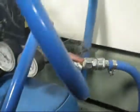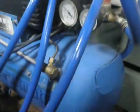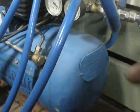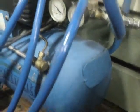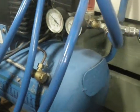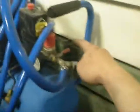If I choose to — if I don't need this much air — I can just turn this tap here and it shuts off this tank, so the other tank charges much faster and I can do tire pressures or something. If I need to use the rattle gun heaps, or even spray painting or whatever, I've got this and I can fully regulate it too.